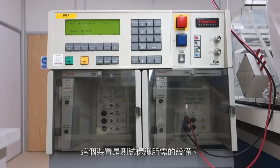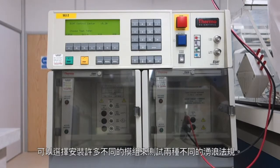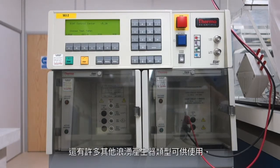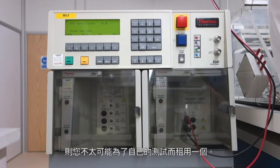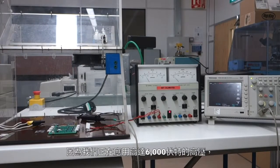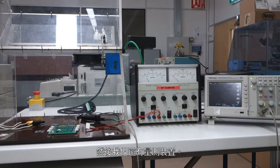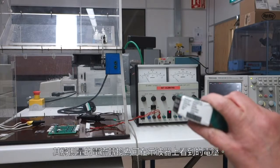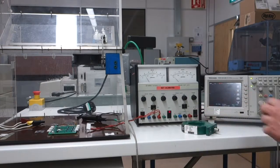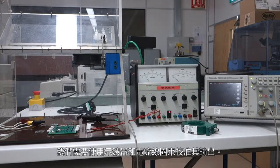This unit is the equipment needed to test such a board. This is an ECAT surge generator, which is pretty much an industry standard surge generator. It has the option of installing a number of different modules to test to different surge standards. There are many other surge generator types available, and if you don't already have one in your lab, you are likely to be able to rent one for the purpose of your own testing. Because we are dealing with high voltages, which can be anything up to 6kV, we need a safety box to keep our own hands away from the devices under test. Then we have the measurement gear itself. The key items here are the oscilloscope and the current coil, which converts currents measured into voltages that can be seen on the scope. Before we do any test work with the surge generator, we need to calibrate its output with the oscilloscope and the current coil.